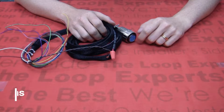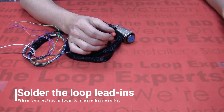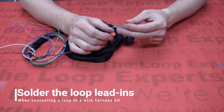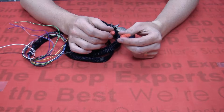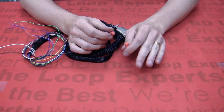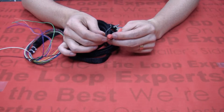If you're connecting your loop to a wire harness kit, you need to solder the connection. Just twisting the wires together and screwing on a wire nut is a bad installation practice. Never just use a wire nut to connect a loop to a wire harness kit. The problem with wire nuts is that they are made for 110 to 220 volt circuits. Most loop detectors energize the loop with only 3 to 6 volts. At this low voltage, any oxidation of the wire joints can create enough resistance to cause the detector to have false trips or even lockup.